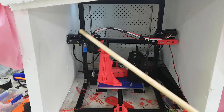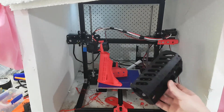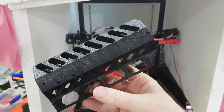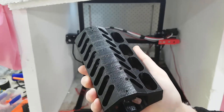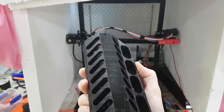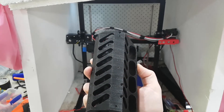I've got my polystyrene enclosure with a sheet over it. I really can't get over how much maintaining a constant temperature improves print quality. Here's one I printed without it — it's all right — but I made it again with the enclosure back on. This part takes 24 hours to print and I'm in an uninsulated metal garage that goes from below zero to around 25°C, which definitely affects print quality.